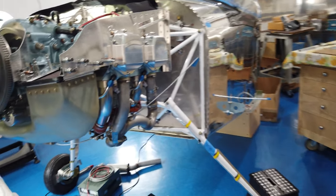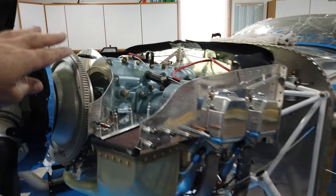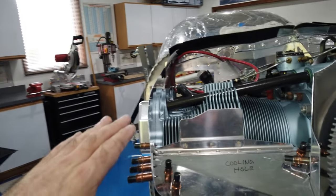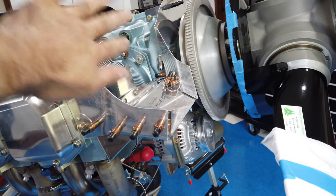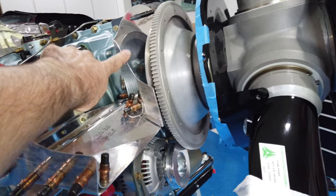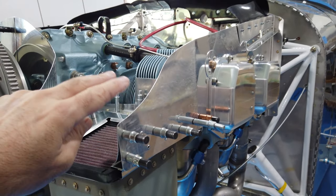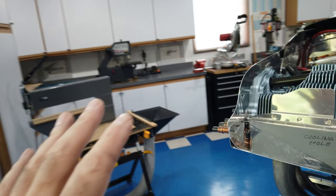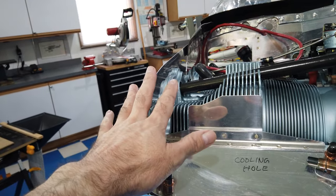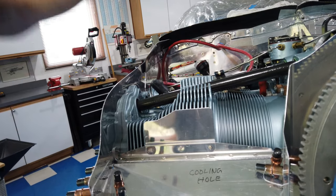What I had done was put the bottom cowling on and then one at a time put the pieces that needed to be trimmed. This front piece needed to be trimmed to the inlet ramp, this piece here needed to be trimmed, the piece on the other side, and this piece here. So I took these off and one at a time started with this one — put it on, had the other ones off, put the cowling on.